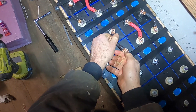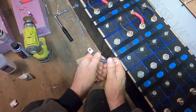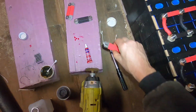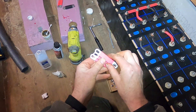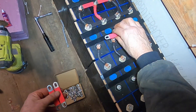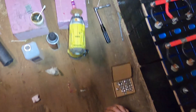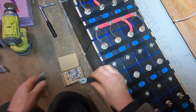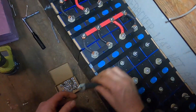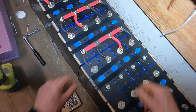If I bend those cables, they can span various distances. Even though the cables are all a little bit longer than they need to be, by doing so I can span pretty much any distance I have between my batteries. Here I have the bus bars that came with the batteries from China — these have already been gooped up with the antioxidant goop. I've been putting shrink tube red on the positive terminal so the outside ones go first and then the inside one so that the height matches. On the negative terminal — that one's not quite flat, there's some shrink in the way, so I'm going to have to clean that up carefully.